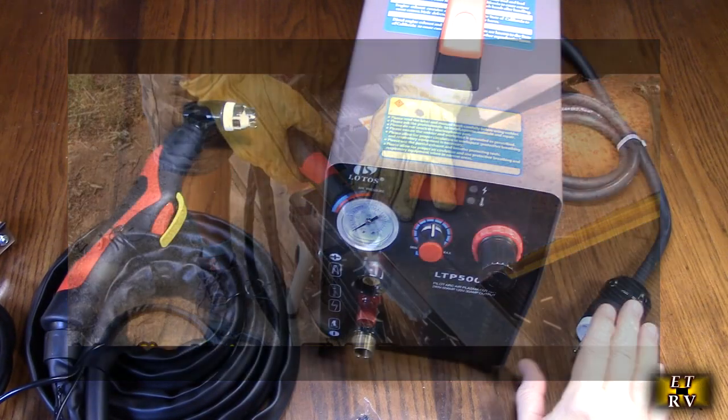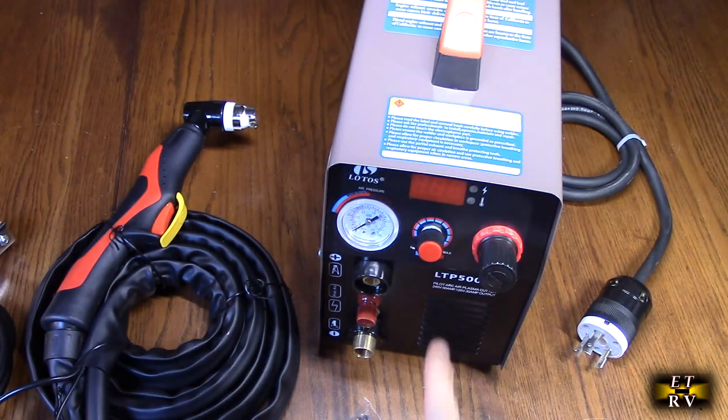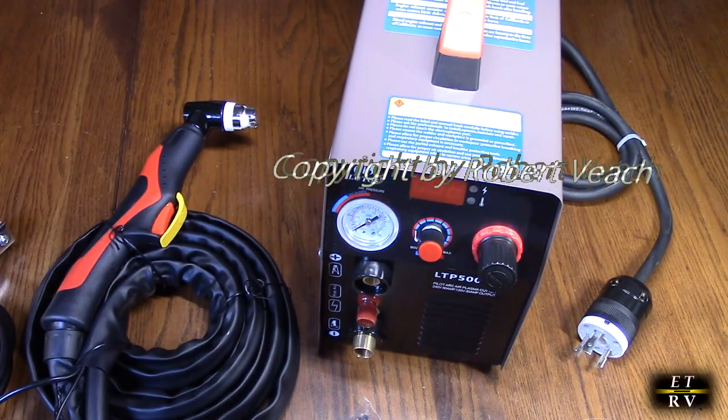You can satisfy the requirements of 240 volts and you want to give it 30 amps at that level. If you're going to go to 120 volts, you're going to have to have a 40-amp breaker — but again, I wouldn't recommend it. I recommend you go to 240 volts.